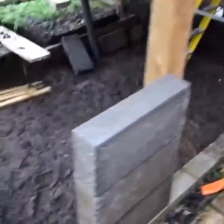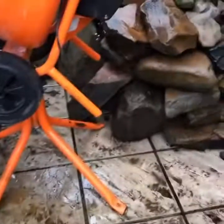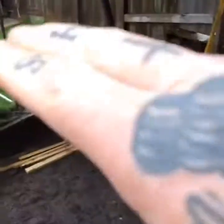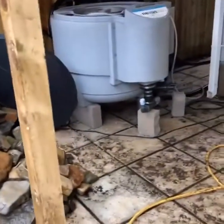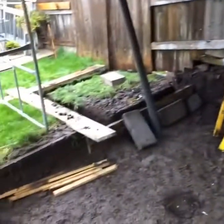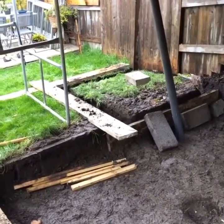Why is it always raining? So there we are — I've got a muddy hole, got some footings over there that I'm going to pour today. Got a skip coming soon. I reckon I can get rid of some of these stones in that slab I'm doing because I need to raise it up a little bit higher to get the levels right, otherwise it's going to be stuck on blocks. So I'll do the footings, put a small wall in there, and then work out where the slab's going to go.